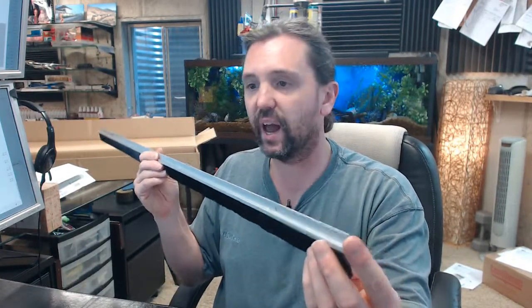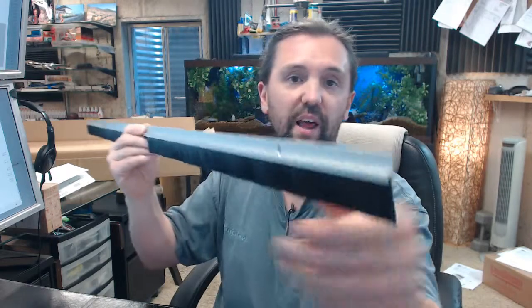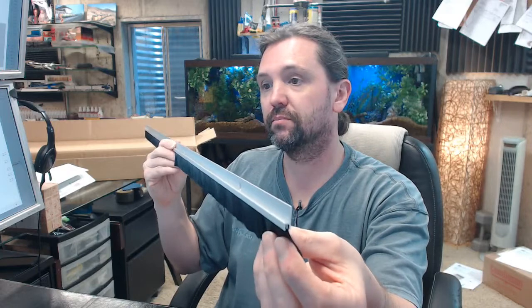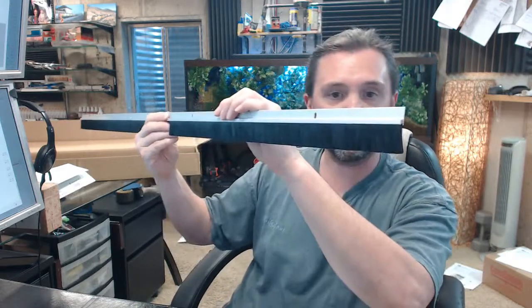The A180 is representative of the profile of the holder. The CLA stands for clear anodized aluminum. The 10 in the part number means that the length of the bristle is 1 inch, and the BL means that it's black. Okay, a 1 inch bristle length, which happens to be black. This happens to be a 42-inch size.